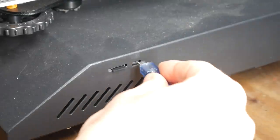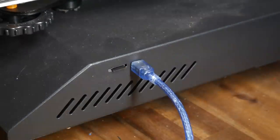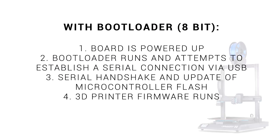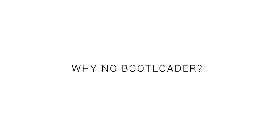An 8-bit mainboard is slightly different because we plug in a USB cable between the printer and our computer. The bootloader still runs first, except this time it tries to establish a serial connection to the computer, and if the computer has the same intent, they handshake and then the program space is updated, then the 3D printer runs as usual.